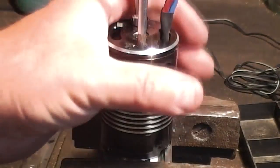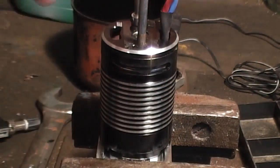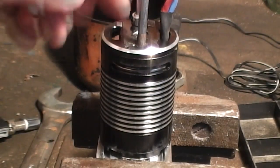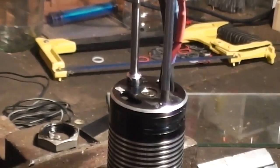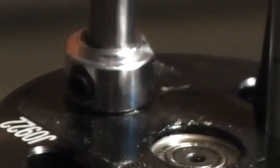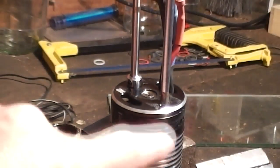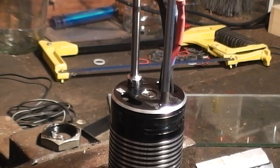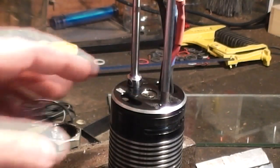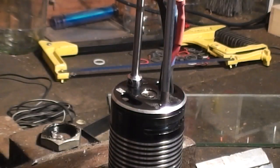I'm just pulling my 600 motor apart. You've got to carefully peel the sticker off the top. What I've done is I've used a 450 main shaft with a collar on it to stop it from sliding down too far — to stop the shaft from going too far through and hooking into the windings. I've got an old screwdriver Phillips bit that I've ground the Phillips off, and that sits in there nicely. It's really, really tight to get this off, but I've cracked it off now.